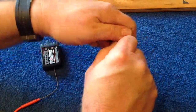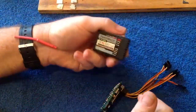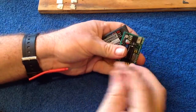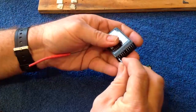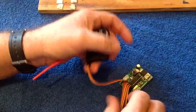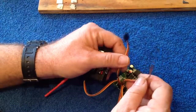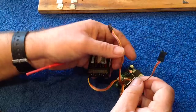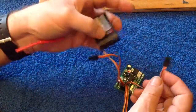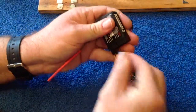We won't be doing that using the six-channel. We'll be running with the eight because that's a little bit more complicated. So your eight-channel receiver. To connect up your eight-channel receiver, input one goes into channel one, making sure that the yellow wire is on the top. Here is the tricky bit: you need to swap around channels two and three. So input three on the RC5HL must go into channel two.